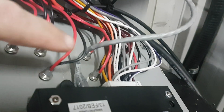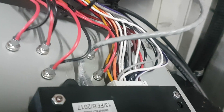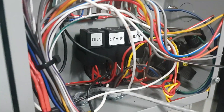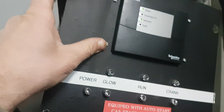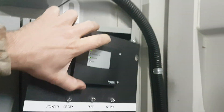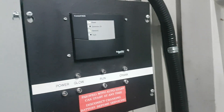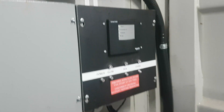Out of the AGS, there's 26 or 23 wires — there's a pile of them. Those wires, we correspond the correct ones to their relays and away they go. Now depending on your model or the equipment that you're using, if it's a propane generator or a diesel or a gasoline generator, you may not need all those relays.